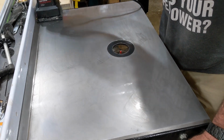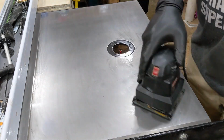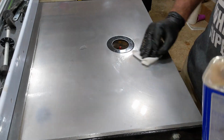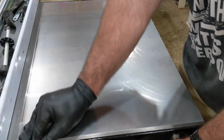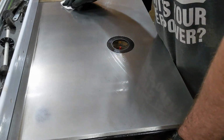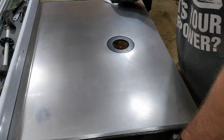I think poly is great on cast iron when it will stick, but I don't think I'm willing to degrade my cast iron just to get it to stick. Although I think it would work, it seems like at that point it forces your hand on keeping some kind of protection on the surface. An etched piece of cast iron just seems like it would be a rust machine if you didn't stay on top of it. And not staying on top of it is what this whole experiment is about.